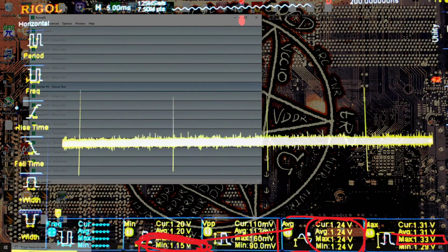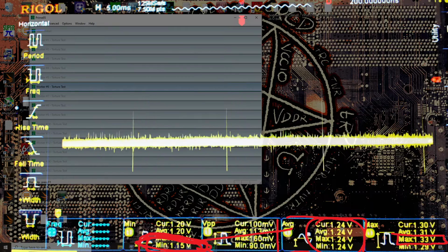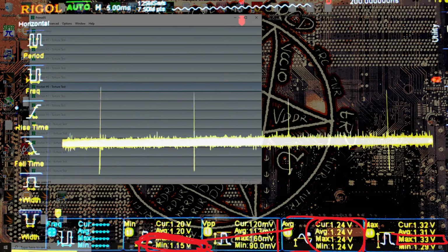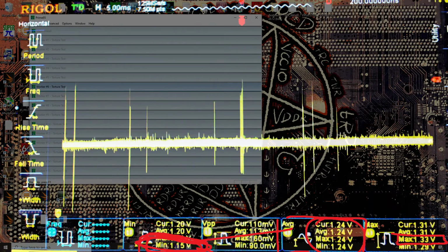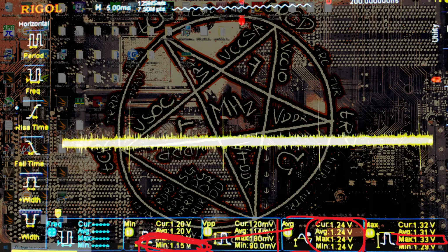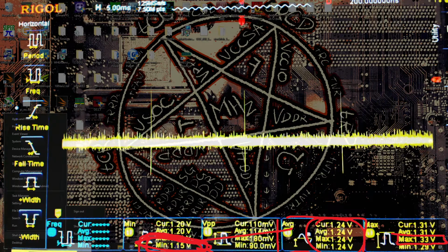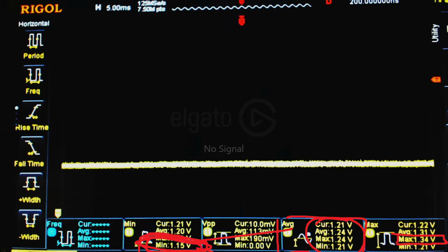So, yeah, that's one of the main reasons I don't really pay attention to overshoot. Unless your motherboard is incredibly bad, it is extremely unlikely that the overshoot is going to be so high that it actually is a reliability concern for the CPU. Anyway, let's restart and use some far more reasonable LLC settings.